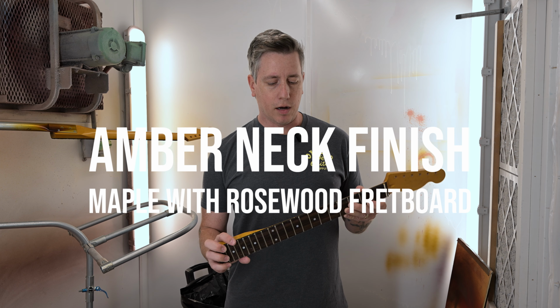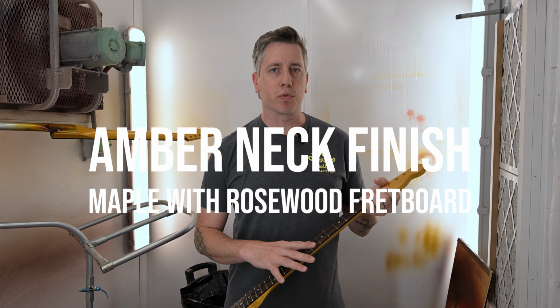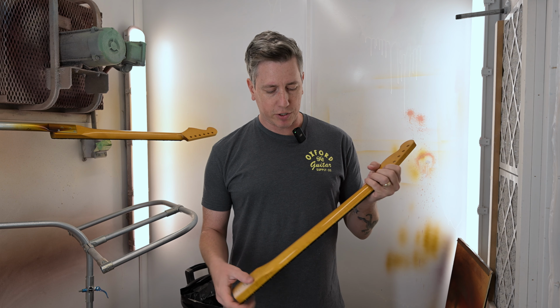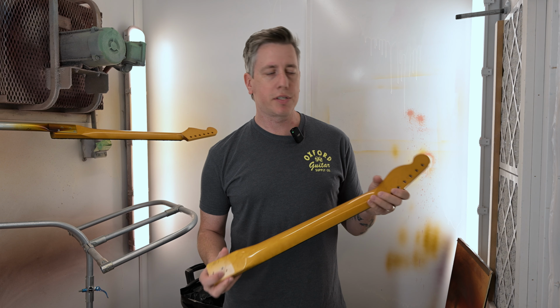Today we're going to take you through the process of finishing a neck. This one is a maple neck with a rosewood fretboard. So first we'll tape off the entire face of it, do our sanding sealer coats, a few coats of neck amber just to bring out the grain, and then our clear coats.